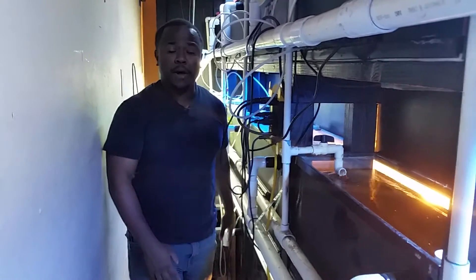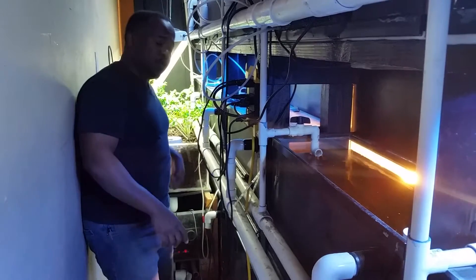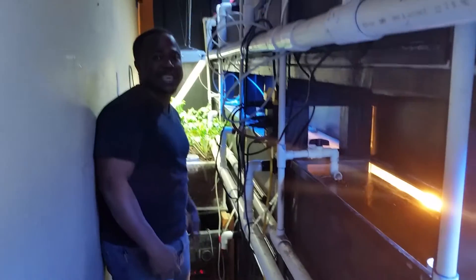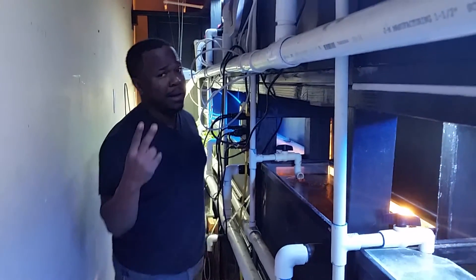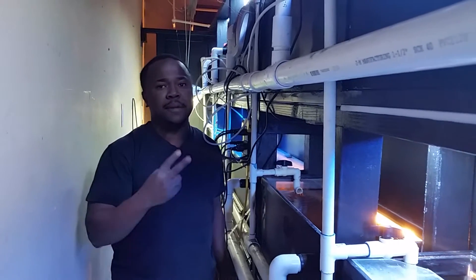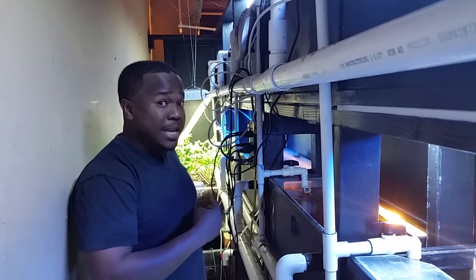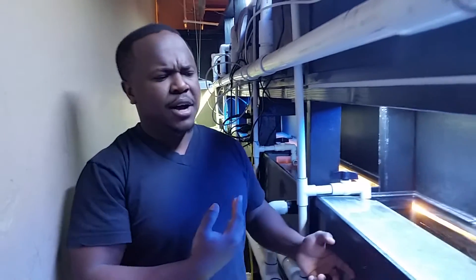The amount of water that stays here — the bell siphon just hit. So the water comes down, the bell siphon kicks in, everything goes down to where it gets heated. We have a two to three minute retention time with close to two or three heaters of up to 250 gallons. Those three heaters heat all our 18 tanks, as compared to putting one heater in every tank which uses a lot of electricity. And it's been working for us.